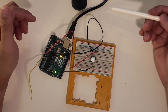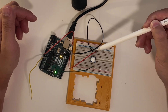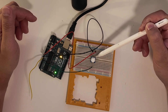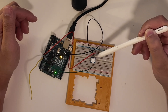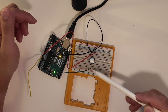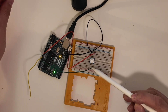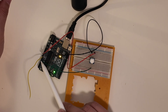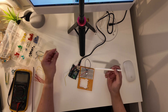You can see it's a very simple circuit. I just have a 5-volt line — the red one — going into one prong of the potentiometer, and then negative on the other prong. On the opposite side of these two, right in the middle, we call it the middle prong — that is the signal line, and that is connected to the A0 analog-in pin on the Arduino. So: five volt, ground, and signal.